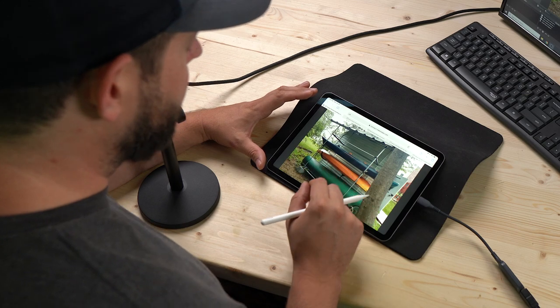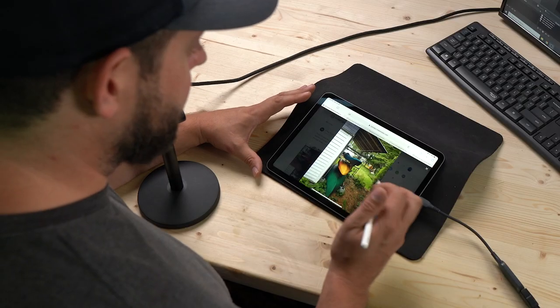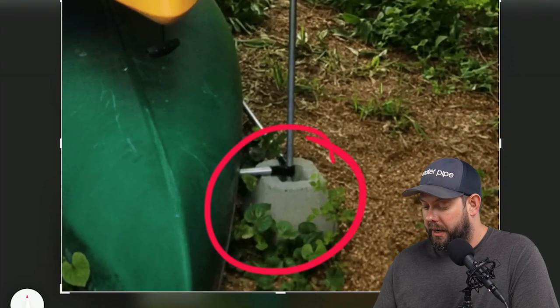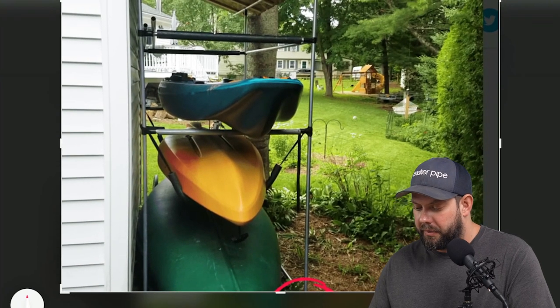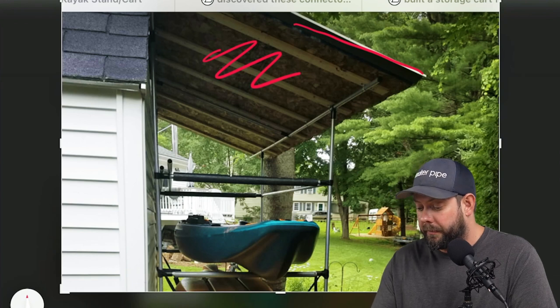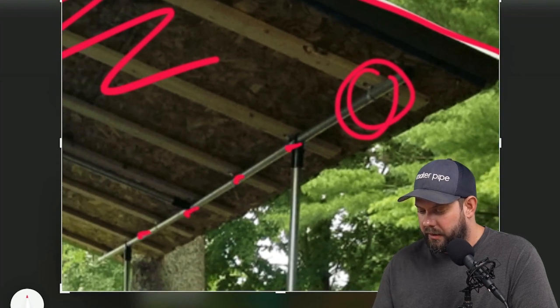The first one was posted by Craig just this week. He made this really slick kayak storage on the side of his back shed. Some of the details he did: he got these concrete deck footings that you can get at any big box store, and he built off of that to give a nice sound foundation. Then he attached a shed-style roof to the top, using OSB plywood with a metal roof mounted on top, and attached it to the conduit with two-hole straps, marrying the plywood right to the EMT conduit structure.